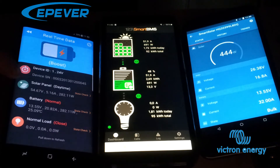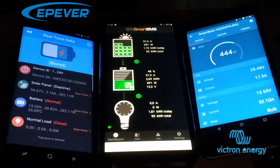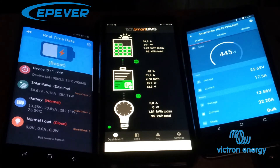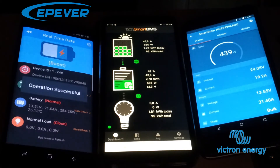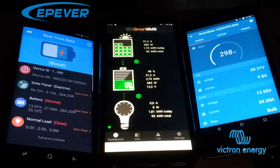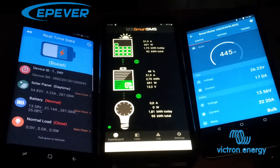The EP-Ever is now at 54.67 volts at the solar panel input, charging with 5 amps and 282 watts, and charging the battery with 20 amps. The Victron Energy is charging the battery with 32 amps — much, much better than the EP-Ever, even though the panels are the same. The only difference is the Victron Energy has them in parallel and the EP-Ever has them in series. The Victron Energy charge controller was tracking again to find the maximum power point. Now we're charging with 691 watts. The EP-Ever is charging at 21 amps at the battery, PV input at 54 volts and 5.23 amps — 287 watts.